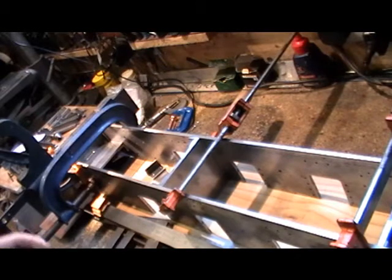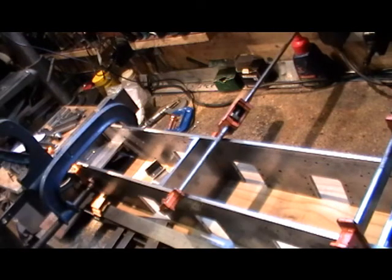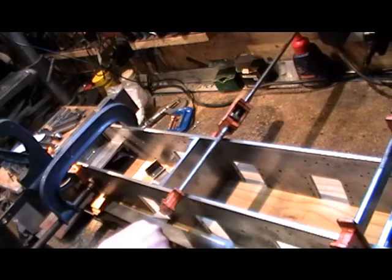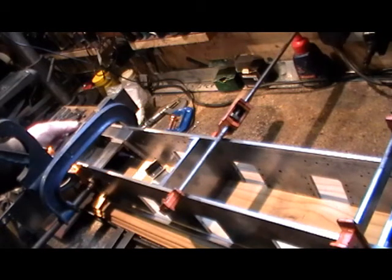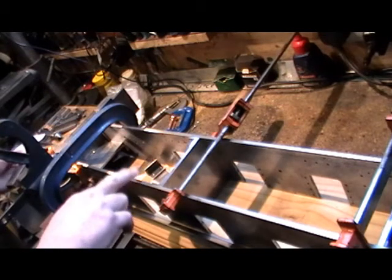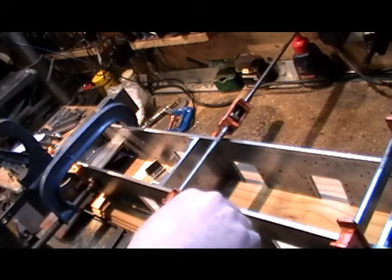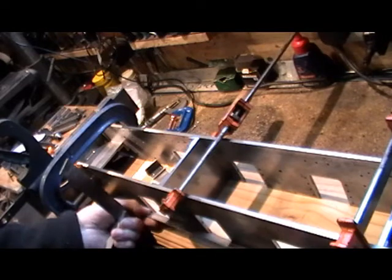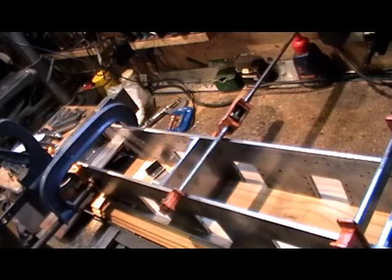I'm just going to do a little progress report and update before I go any further. In my last clip I mentioned I was going to take these angles off on my buffer beam so I could transfer the holes in from my frame - I've already explained that. But before I take that off, I've managed to get everything squared up - everything's parallel, everything's square, everything's flat, nothing's rocking. It took me a while to get that squared up. The reason being, this side had a very slight curve - a little bow in the frame side - which I didn't notice before. I put my straight edge on and it was just slightly rocking.